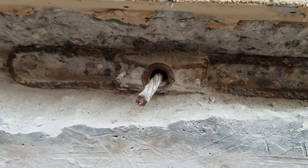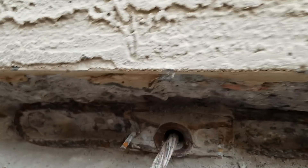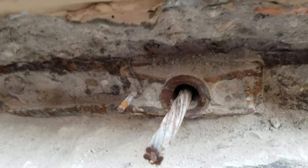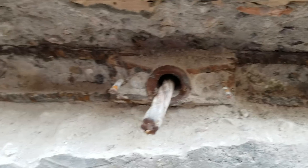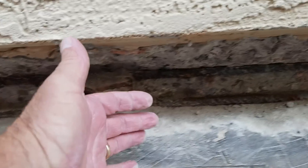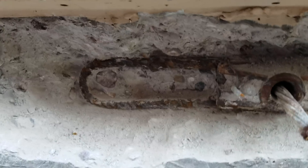We're here on the post-tension foundation on this home. What's going on is this hairpin back here — this rebar and this collar, or saddle, is rusting. When rebar or any steel rusts, it can expand up to five times its diameter. It then starts to expand and break out the weakest side, which is this side. The concrete on the other side of this rebar is very solid, so we chip all of this out to get to this rebar pin, clean it all off, rust-inhibit it, and patch it back.